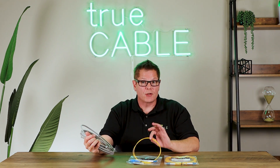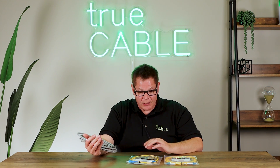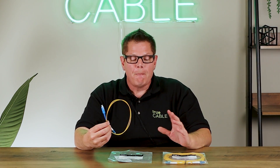There are some significant advantages to fiber over copper depending on what you're doing, but obviously there are some disadvantages to fiber as well. Fiber is capable of carrying data at very high speed, but it can't do it while doing Power over Ethernet. If you want a remote device powered up — like lighted signage, a surveillance camera, or an access point — you can certainly get a signal over fiber to it, but you can't power it up because you can't transmit DC voltage over glass. So copper is going to be with us for quite some time — it's got applications that fiber cannot serve.